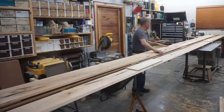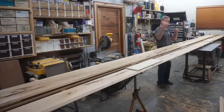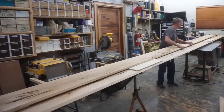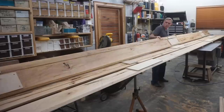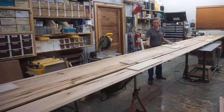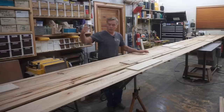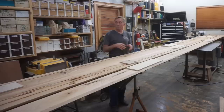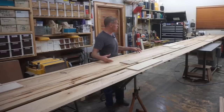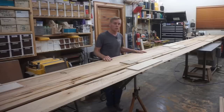That's the 1x8. And I've got these pieces of beam oriented so that it'll all assemble the way it is. I don't have to pick these up and flip anything end for end. But I can flip this 30-foot 1x10 over onto the ears on this side of that work surface. And I already got everything lined up and laid out for the assembly blocks so that I can proceed with gluing those and screwing them into place to put the two sides of the beam together like I did previously with that single 12-foot section.